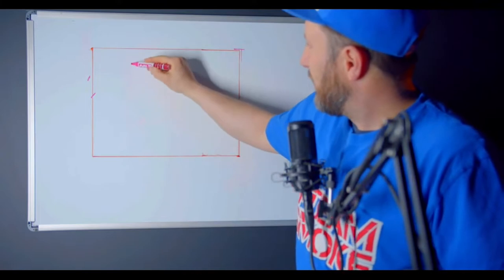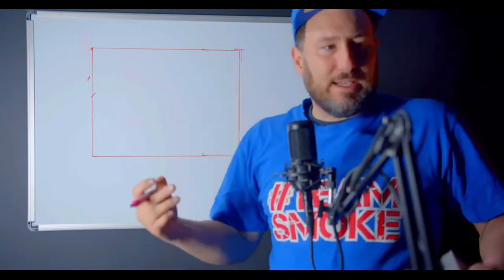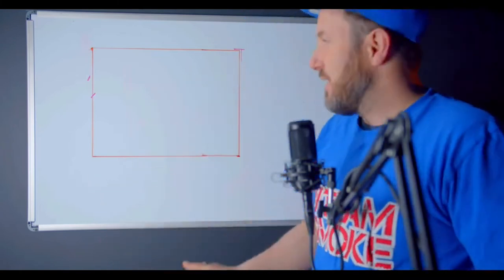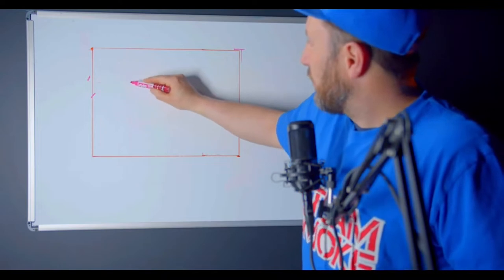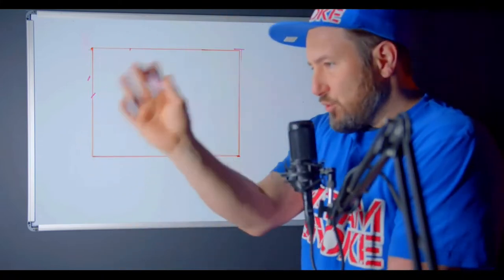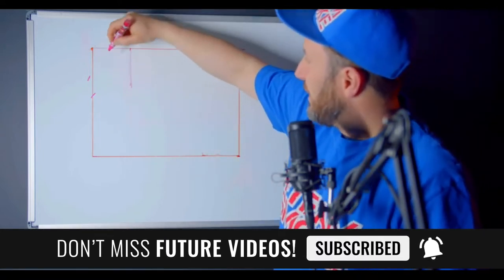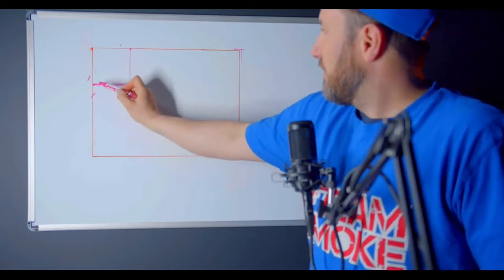To make a wall that comes this way, it's pretty simple. You're just going to take your tape measure — just got to pay attention to the thicknesses of your drywall and make any adjustments. That math is on your prints. We're just talking about how we get our lines. We're going to mark across, make a mark down here. Keep your tape measure as straight and square as possible visually. You're not checking square — you're just taking your mark, snapping your line. Same thing for this wall: come off the exterior wall, get your marks, snap your line.